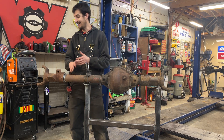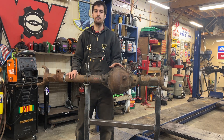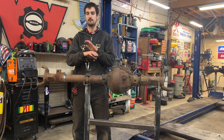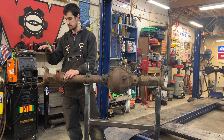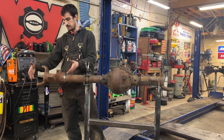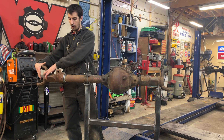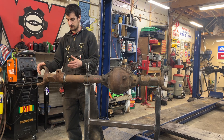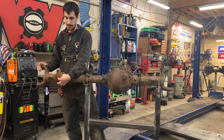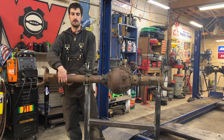So how do I like to do it? If you've watched my other videos, I like just removing the inner C off the axle tube — especially if you're working on Dana 44s and Dana 30s. I know Dana 60s are a different story. We're talking Dana 44s and especially the 78-79. Guys get worried on these axles because the inner C is welded in one unit with the wedges. But this whole system is still just pressed on to the end of the axle tube. You have about two to two and a half inches of axle tube inside of this, with one weld going around right here.